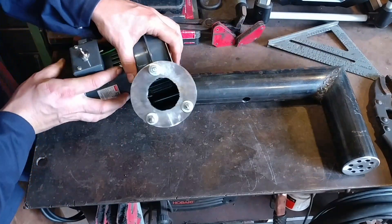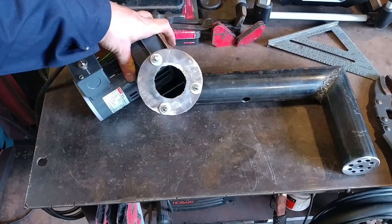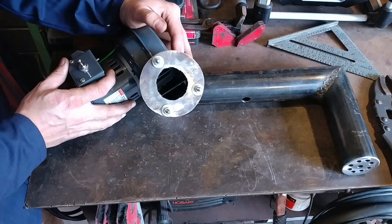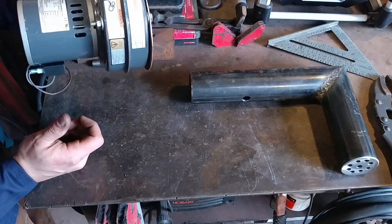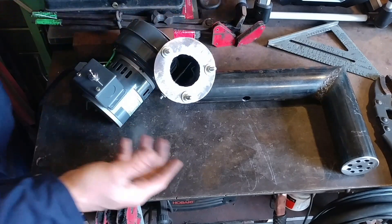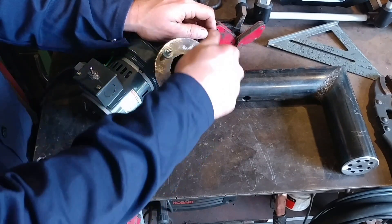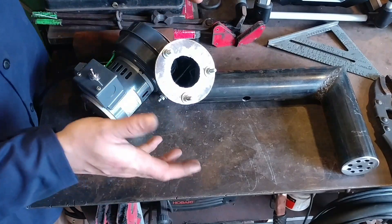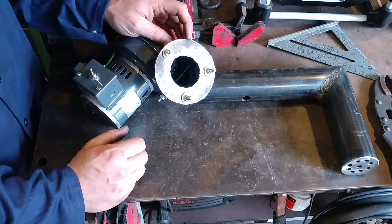The reason why this orientation step is important is because, if you look at these, the bolt holes are not equilateral distances apart — this is not a perfect triangle pattern on these blowers. I don't know why they would do that. This is a Dayton blower, but it was made in China. So this is the stage where you set up what your final burner orientation result is going to be.